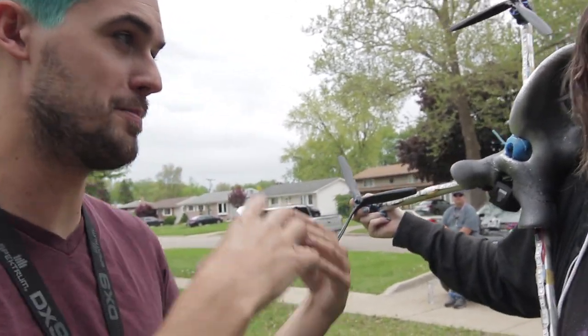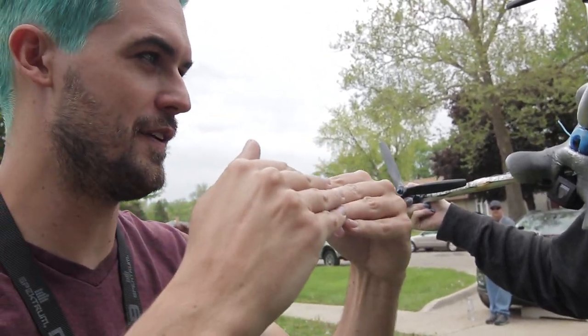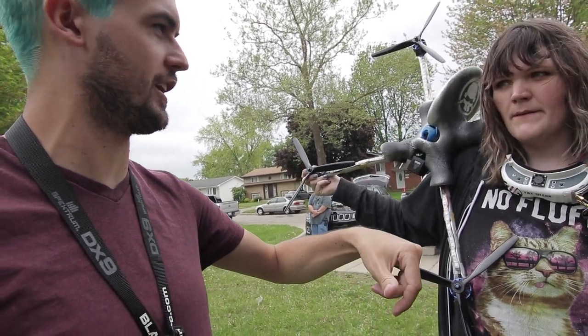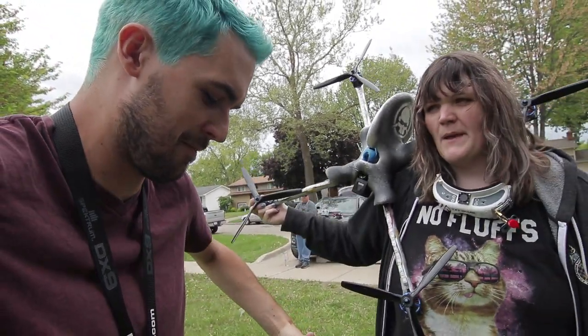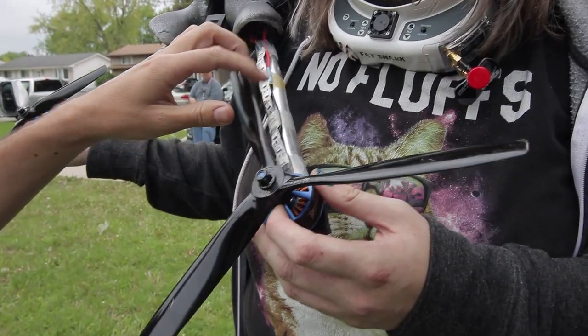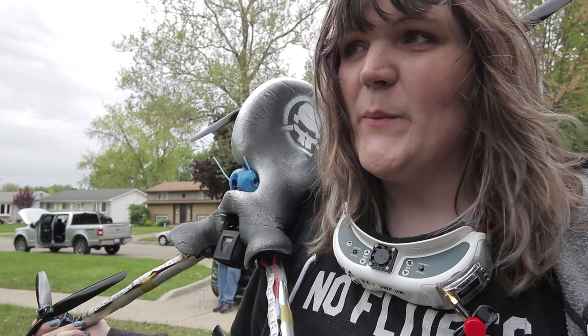You can only go up in like 5% increments, it feels like. So if I'm at 30% throttle and I raise to 40% throttle, I hear a change in the motor, but anything above 40%, I can just wiggle the stick. It's not doing anything until the motors catch up to 40%, and then I can go up another 50%. You have to work your way up, because I went to 100 and it's still spooling up just as much. It takes a minute for all that. Well, this one prop weighs 30 grams. It's pretty heavy. And the props are big. These motors are heavier than some entire quads.